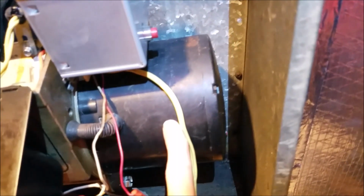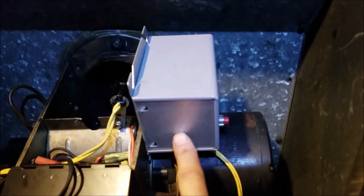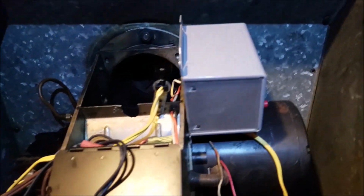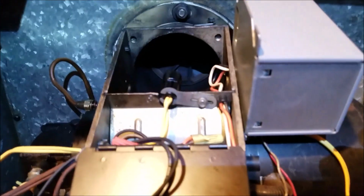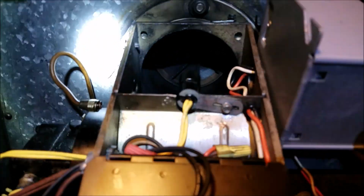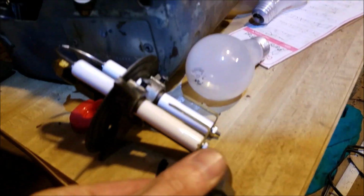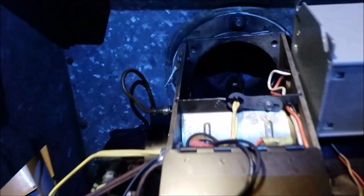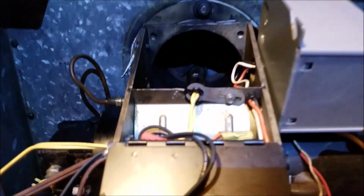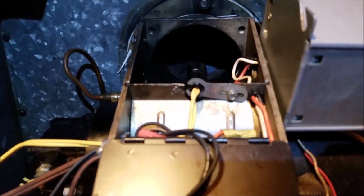And of course, here you got your motor, and you got your blower wheel that blows air across it. And this is like a little brain box. So together, when you first light it, you'll find out here in a second, when the fuel pressure comes out here, it ties into this. It sprays out that nozzle under pressure, like a real super fine mist of fuel oil. I'm using #2 fuel oil, so I get a little more heat out of it. And then you've got, of course, the electrodes. It's constantly arcing, so it's what ignites it.